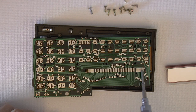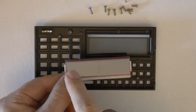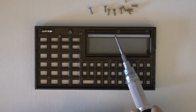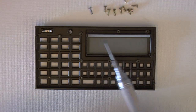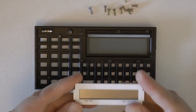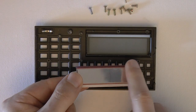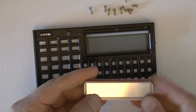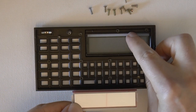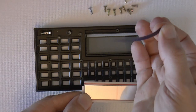This is where the LCD connects to the printed circuit board using an elastomeric strip. There is another elastomeric strip on the other side — it may be stuck to the LCD or stuck up on the board. On these LCDs the only connection is along the bottom side, so the elastomeric strip along the bottom has the conductors in it, and the other elastomeric strip does not. It's important to realize which one is which. We can just peel off the elastomeric strip and set it aside.